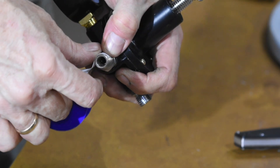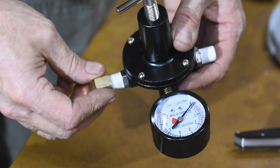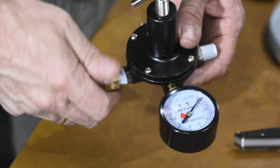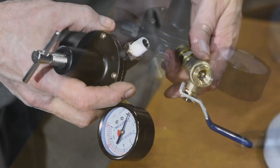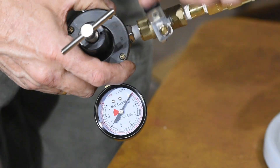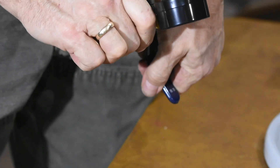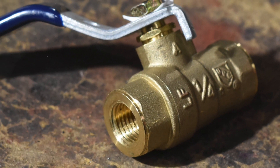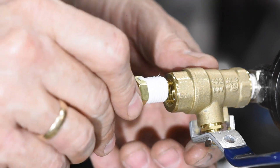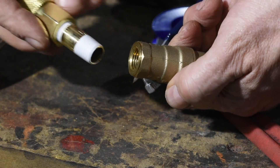This is the regulator inflow, and these two are outflow. I'll cap the first outflow port, and here on the inflow I'll attach the ball valve. I've seen people who didn't use a valve here and just relied on the regulator, but this is really important — you really don't want to run air straight in here unimpeded. You can screw up and over-pressurize the pot, and you really don't want this thing exploding on you because you turned the regulator the wrong way or the pop-off valve got jammed. Then I'll add the male quick connect connector. You could go the other way, adding a nipple here if you want the female connector on that side.